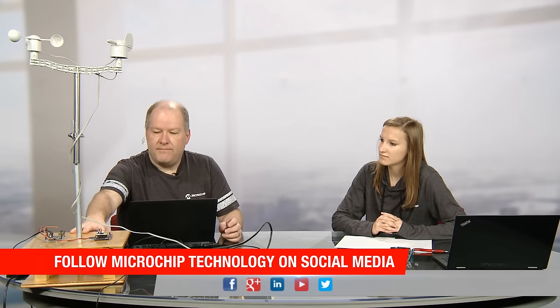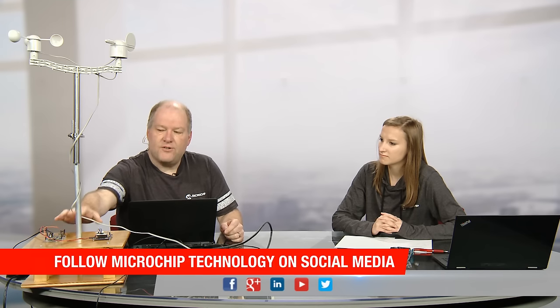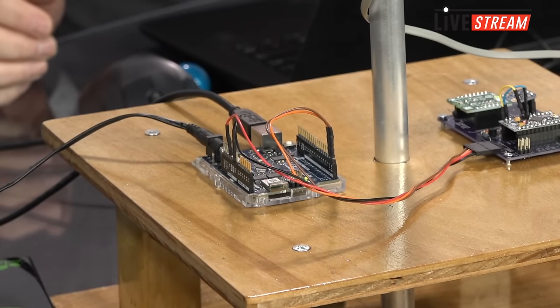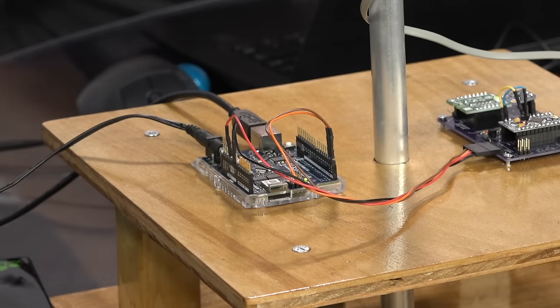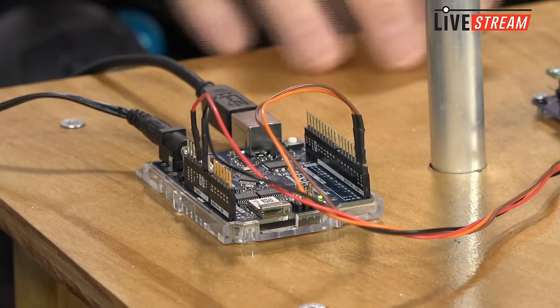The two boards up on this weather station, version 1, is actually the Arduino Wi-Fi Rev 2, and that's the latest Arduino board that's been released, or one of the latest ones, which is what those lucky winners won. It is based on our new Mega 4809 AVR, which has enhanced peripherals. It's a step up from the venerable 328P, which all the Unos and all the 8-bitters are based on. It also has a Wi-Fi module, an accelerometer module, and a crypto secure element, which is going to come into play later on another thing, on the middle design.